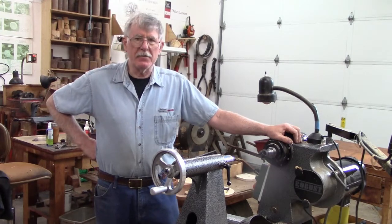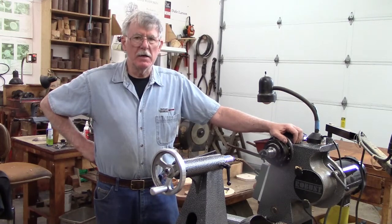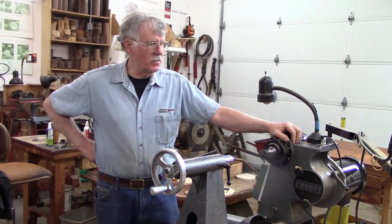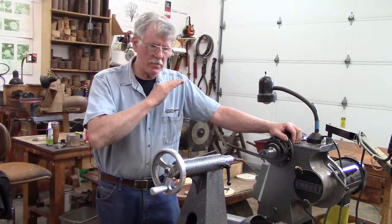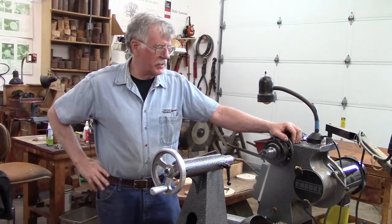I'm glad I had 30 years of turning experience on bowls before I went to it. I use freehand turning to turn the oval. Christian down at Woodworkers Emporium uses all scrapers, and he has platforms to hold it right at what's called 9 o'clock or point of tranquility.